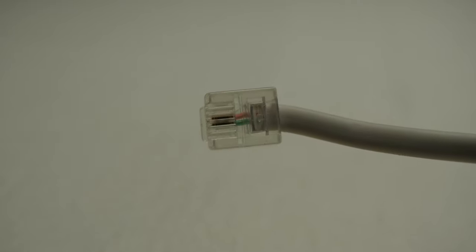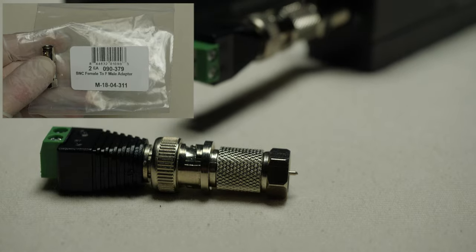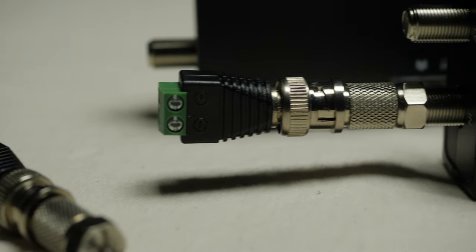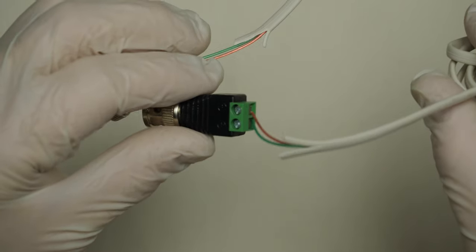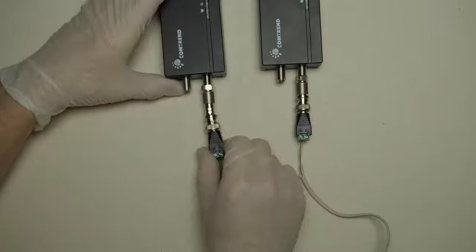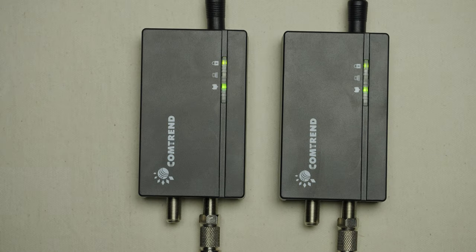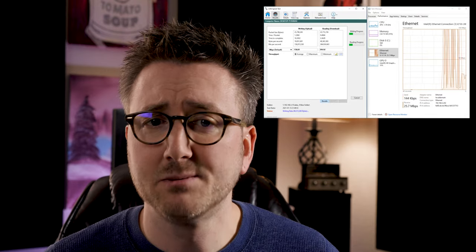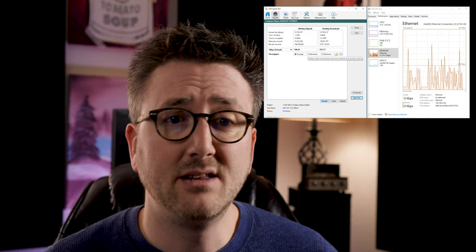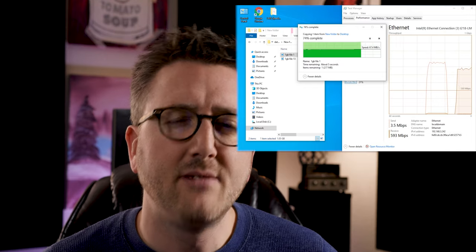I started with a three-foot piece of two-wire telephone cord clamped into a BNC to positive and negative terminal, which was then attached to a BNC to F-connection coax adapter. I did find some adapters that have RJ11 connectors to BNC, but I found them after the items I originally ordered had already shipped. These probably aren't the most sophisticated tests anyway. This setup achieved an average read speed of 472 Mbps and an average write speed of 168 Mbps. Maximum was 547 read and 213 write, and minimums were 200 read and 139 write in the 30 random packet test. The 1GB file showed a maximum sustained speed of 660 write and 579 read.